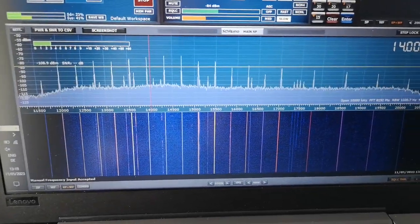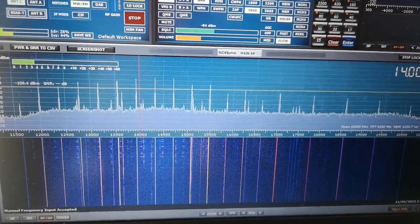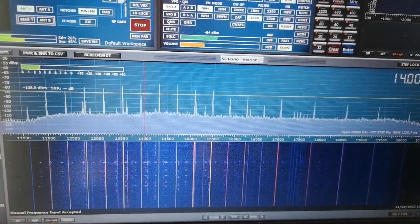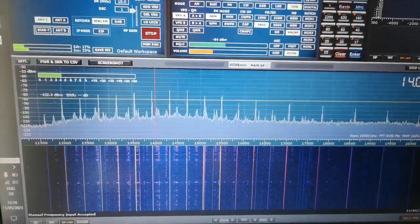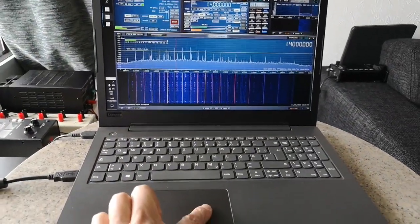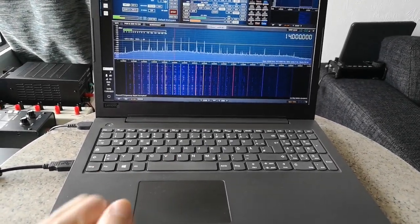the volume, you can hear the noise. There's some noise popping up and down. You can see those little spikes appearing, disappearing, reappearing, and if I turn on the speakers and we listen to the noise, then that rasping sound is coming from the trackpad. Goes away, back on. Maybe you can see it better when I... So you can hear that's noise being radiated from the trackpad.